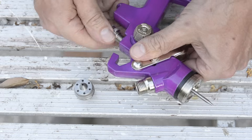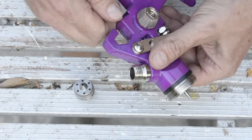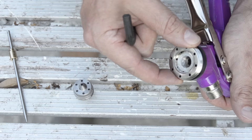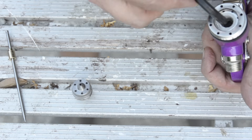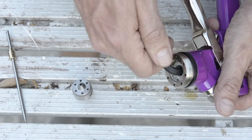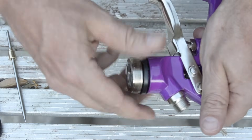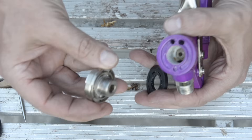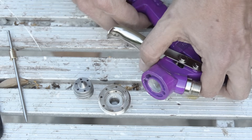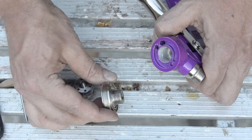I took it all the way down. A couple of things I found out in the process: to get this part of the cap off, you need an Allen that'll get in there. This is a quarter-inch Allen, but I think one size larger would actually be the best. I was able to unscrew all of this and get in here with a wire wheel and clean up the surfaces. Surfaces like what you see there I had to do with a toothpick and a little brush — you can still see some residue — but wherever I could get the wire wheel, I did a pretty good job.